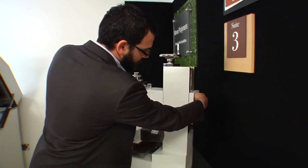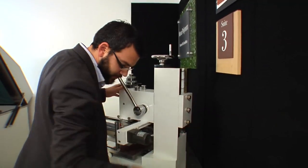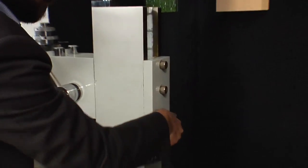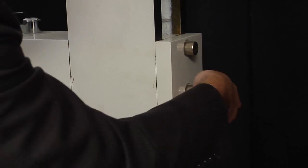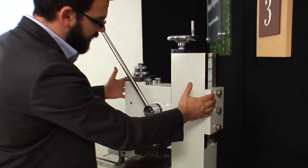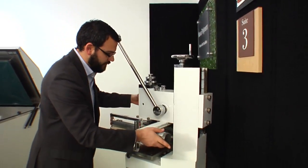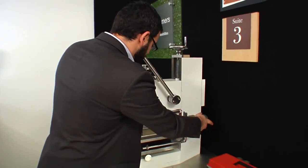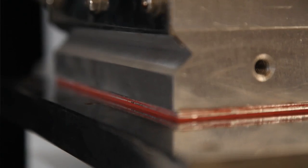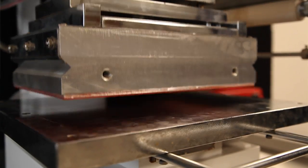I'm not going to tighten them too tight because I'm going to loosen them up one more time — just snug them up a little bit. The reason I'm doing this is as I tighten this it's pulling the head back up tighter. We're going to slide it back and look at it to make sure the platen is level to the table. Pull the handle down and look at the corners to make sure we're nice and level. We actually look pretty good — it's coming down nice and flat on there.